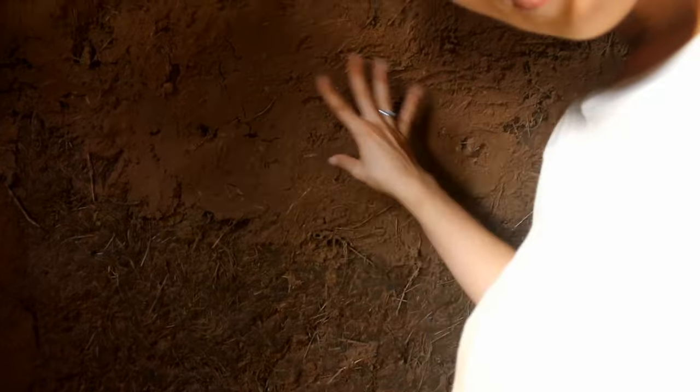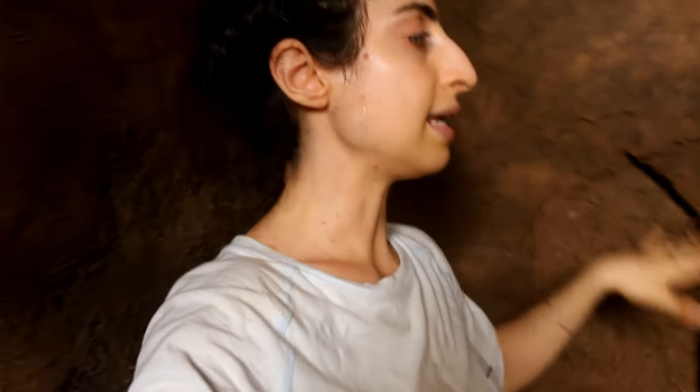So we smoothed out some of the cracks, and you expect cracks to be in your first pass, not as much on the second and the later one. So once you have the first one done, that's kind of your base, your foundation, and then you could add in mud plaster to fill in these little cracks. Then after that, you put on the lime plaster.